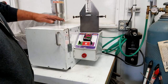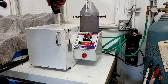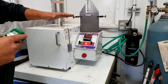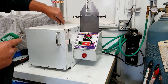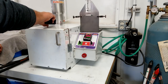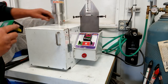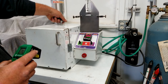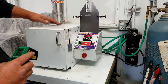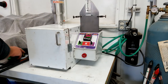We just finished our soak, the alarm went off and I've silenced it. The top temperature is about 185 degrees — hot enough where I can't hold my hand on it — but the argon fitting is still quite cool all the way down to the bushing. The bushing is running pretty cool too; I'm seeing less than 100 degrees, about 98, on this fitting. So we're not risking the plastic tubing as long as you keep argon flowing. That's why I made it easily removable — when running with no gas, pull the probe out.